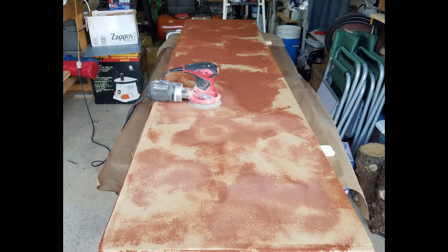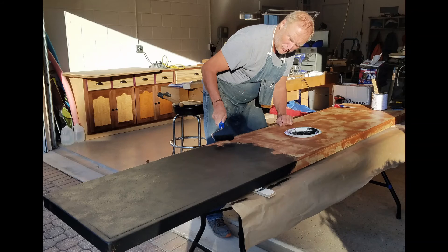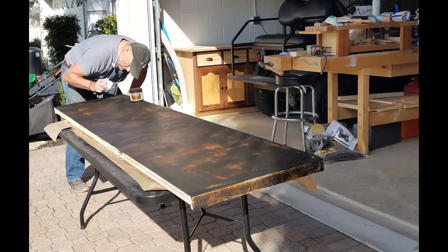I then painted blotches of paprika-colored textured paint, and when that was dry, I sanded through it to reveal more of the hazelnut underneath. Then another coat of chipping cream to protect the layers, followed by a generous coat of peppercorn, which is black. I then sanded through the areas of peppercorn to achieve a faux worn-through layer of paint appearance.